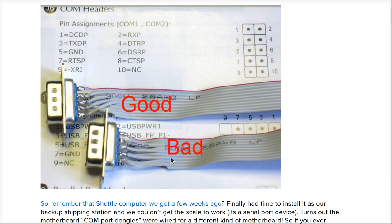Well, on the Z80 Retro, if you build a ribbon cable by hand and you put an insulation displacement connector on the other end, that they don't show, that plugs into this header over here, and you wire it like this, it will work fine, okay? And this, I would argue, is the correct way to use a ribbon cable. Well, this is the right pin orientation. Both of these are completely wrong, and we'll get to that in a minute.